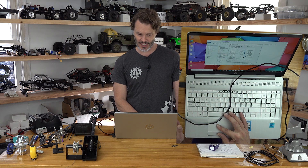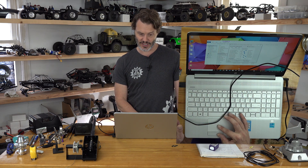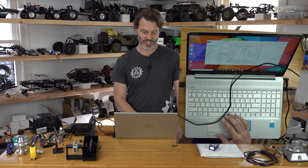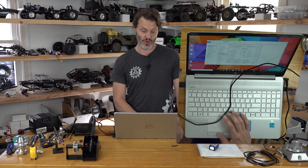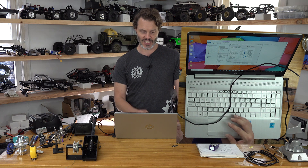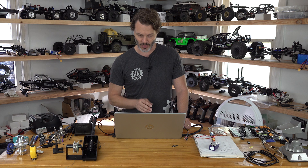I'm going to go back to the stock setting — I believe that was at 14. Let's read and make sure everything is correct. I didn't change any settings at all, but if you did want to change some, you would hit the Save button and it would save to EEPROM — successful. That's how quick it takes once you have the initial binary written on there.